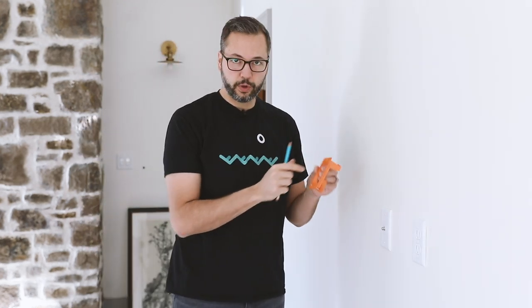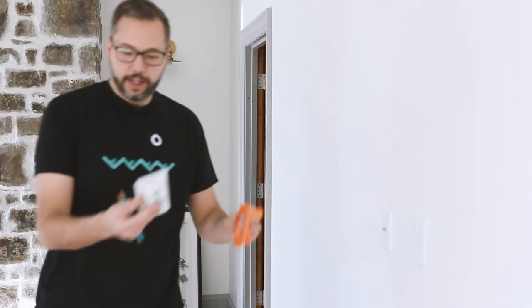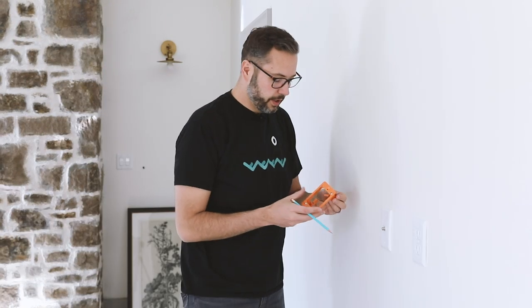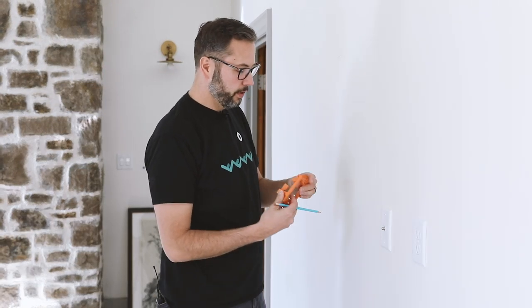Because what we're dealing with is low voltage wiring, or wiring that's already encased like in the case of a plug or something, I'm not going to use a full junction box. I just have one of these pass-through boxes that gives me something to screw into. I've got this box and then this attaches right to the front of it. Installing this is very simple.